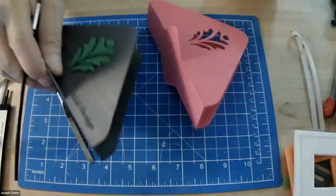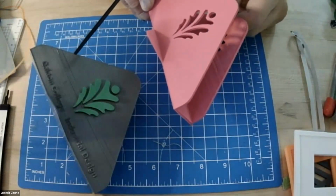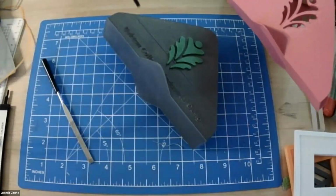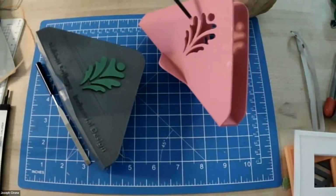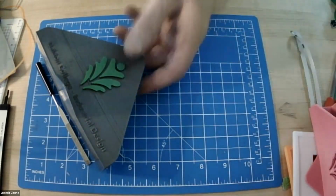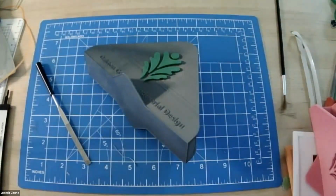The other print that I had designed was to have the logo just being removed. This part takes a long time to remove the support material in the post-processing. So this part is actually quicker and more reliable than this design right here, because this design requires a considerable amount of post-processing. And depending on the type of printer you have, if you have a single extruder printer, then you'll have to chip that away. But if you use a water-soluble support, then you can put that into an immersion tank and you can remove the material that way.